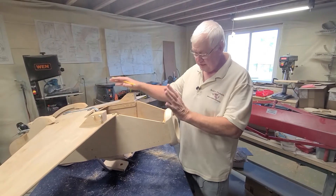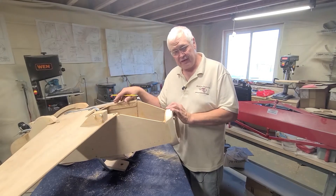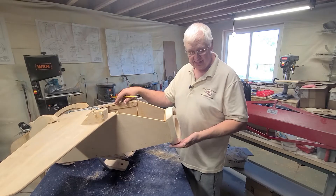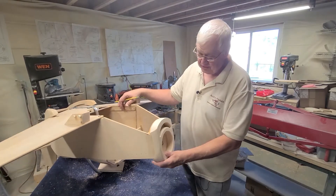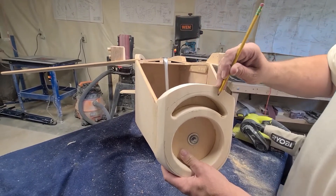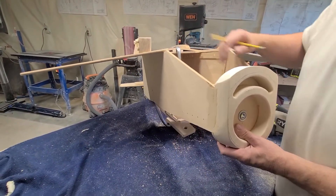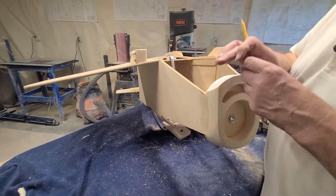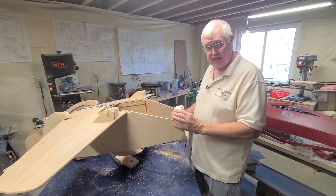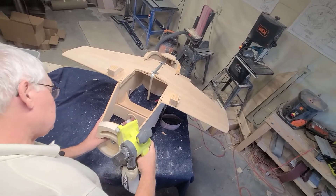Now we got the wing installed temporarily but everything's hooked up. Now we're going to sand the bottom of the nose — this is just going to be a temporary sand, because this has to be fit when you put the lower cowling on and also the upper cowling on. You're going to have to trim or sand this a little bit no matter what. On the nose I want to bring this radius up to about right in here. Plus you're going to want to round this edge here on your fuselage, both left and right. There's no set measurement — it's all done by feel and fit. There are contours on the plans — just get it to fit best you can and it'll look good.